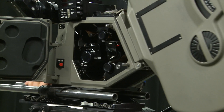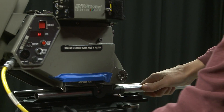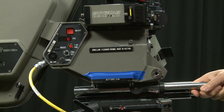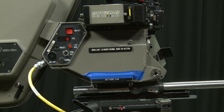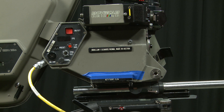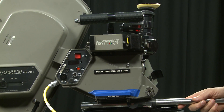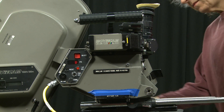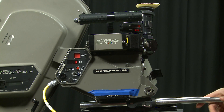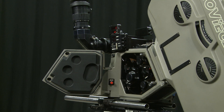That's okay — I've gone over a few frames and can now run the camera safely. Back here we have a zero indicated — that's the sign that the electronics think the camera is happy. If the buckle switch was incorrectly set and there was a jam, it changes to a flashing B indicating a buckle switch trip. Reset the buckle switch; zero means you can run film safely.